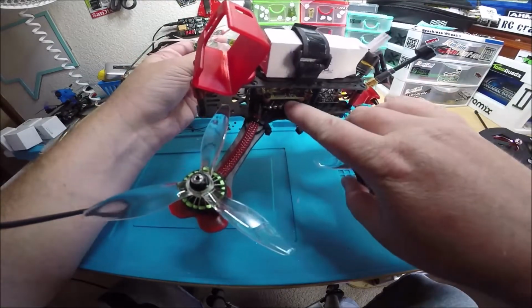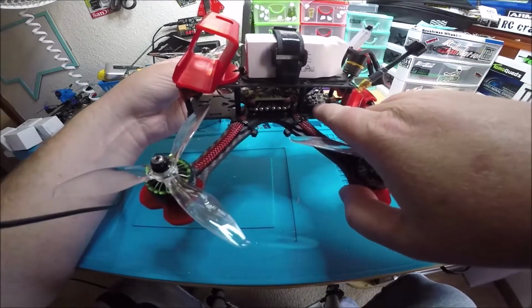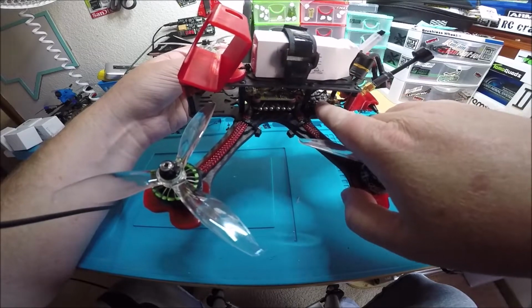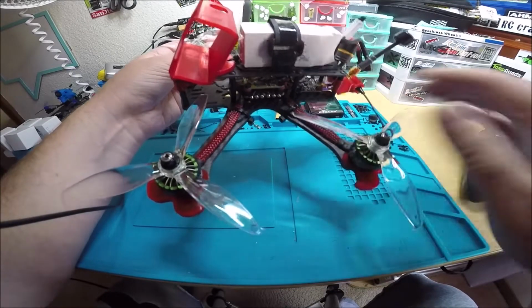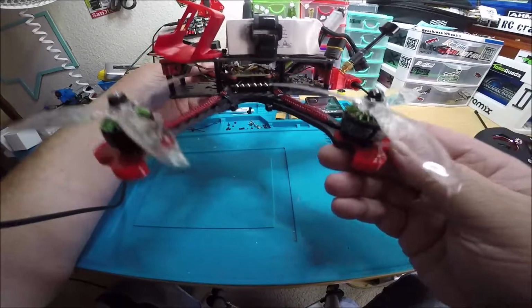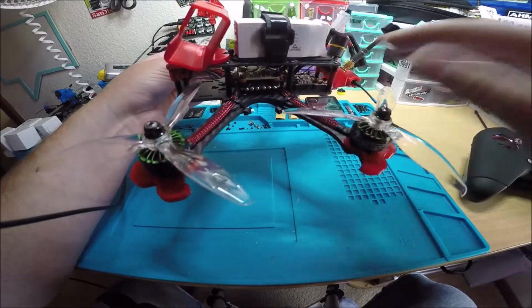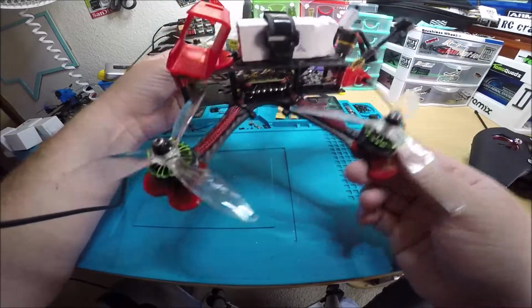You have the Pyro drone stack. There's the AKK FX3 Ultimate in the back here, 600 milliwatts. I love that this frame has the 20 by 20 holes in the back there. Fits perfectly for that VTX. You can have it lifted up in the air, and it just has its own space right there, which is perfect for getting air and accessing it and everything.